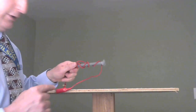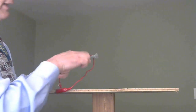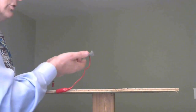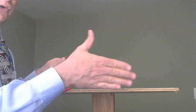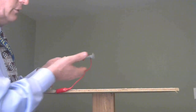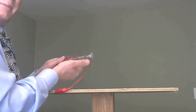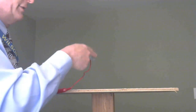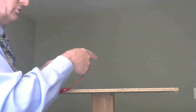Okay, now. Here comes our positive flow over the bolt, but this time we notice that the positive flow goes underneath on the right side. Taking our right hand, fingers extended and joined, thumb perpendicular, we follow the positive flow underneath the right side and our thumb points to the right. This is now the north pole, the right side of the electromagnet.